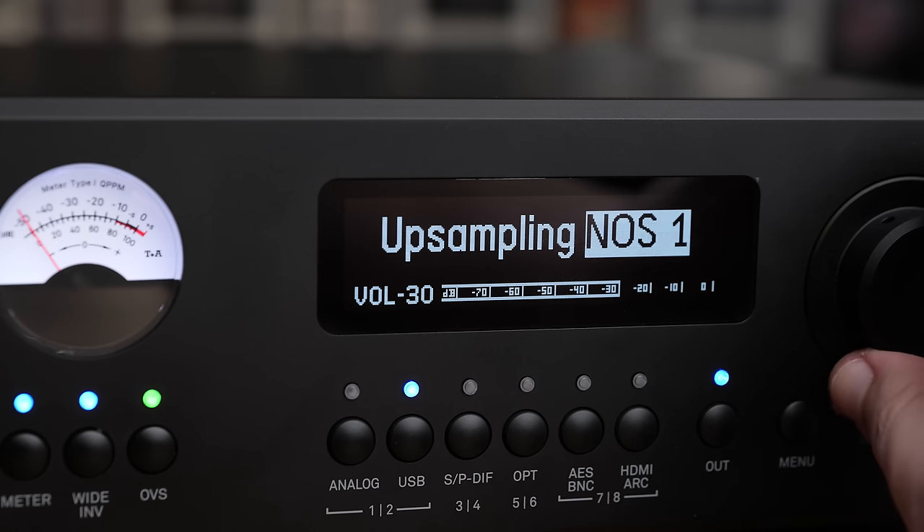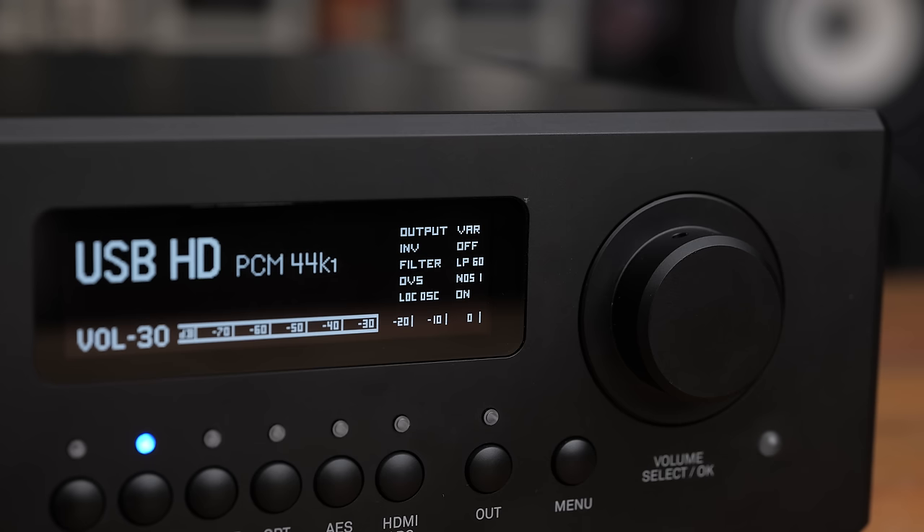Then there are two NOS filters. These are actually the same in terms of digital processing; the only difference is that NOS1 applies an analog low-pass filter at 60kHz after the DAC itself, whereas NOS2 leaves that off. The DAC is not actually NOS though — it does produce a result very similar to what a NOS R2R DAC would output, but it is still doing some oversampling. Delta-sigma DACs usually have two stages: a first stage doing higher-quality oversampling in PCM (e.g., 44.1kHz 16-bit up to 768kHz 24 or 32-bit), and a second stage taking it into the megahertz range at one to six bits. When you enable NOS it bypasses that first stage but not the second, so it's not actually NOS — and you won't be able to take full advantage of tools like PGGB or HQPlayer's advanced noise shapers, because it's still running its own noise shaper on top.